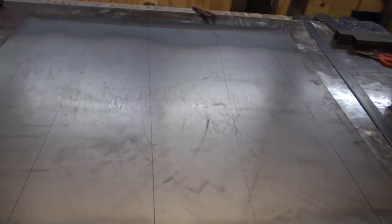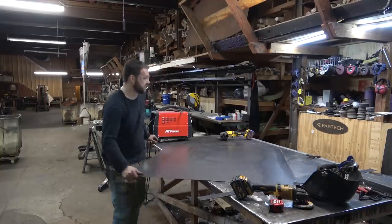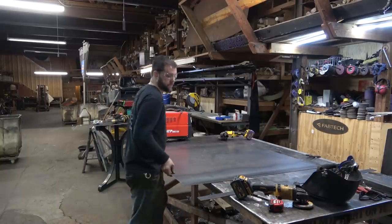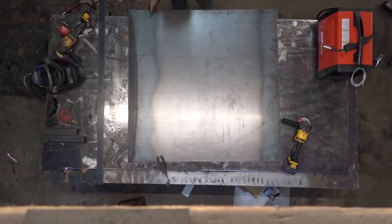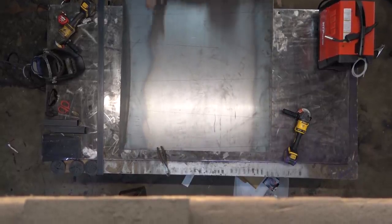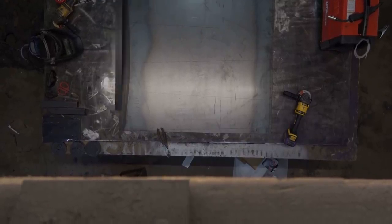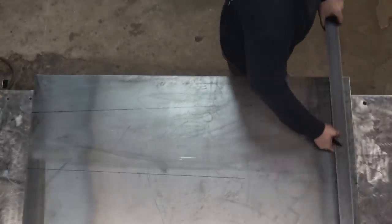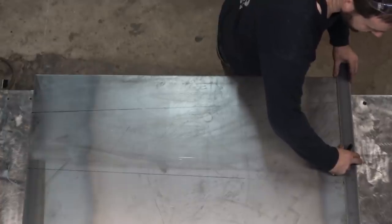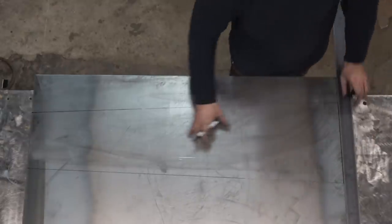Now you'll see with your marks, you have one side with just a skinny little wedge, and one side with a little bit more space. Rotate that space towards you 90 degrees. We're not going to do anything with these first three trapezoids. This last one we're going to work on right now. Measure from that edge up 14 inches. This is where using a 2-inch wide straight edge will come in helpful — line that right up against the edge of the sheet, and make a mark only across this one shape here.